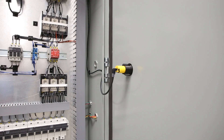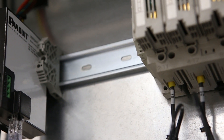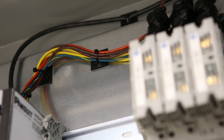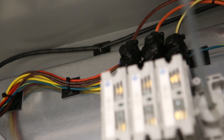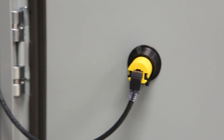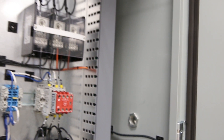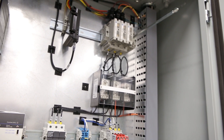The isolation module is located inside the panel. This component can be mounted on a DIN rail or attached to a subpanel. Sensor leads from the isolation module connect to the power conductors inside the panel. There are two sensor leads for each power phase, plus two leads for ground. The system cable is used to connect the isolation module and the indicator module, providing communication between the components.